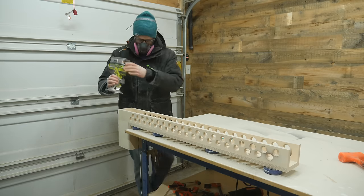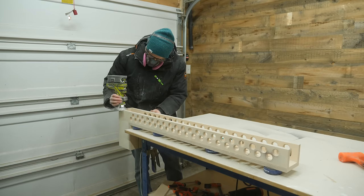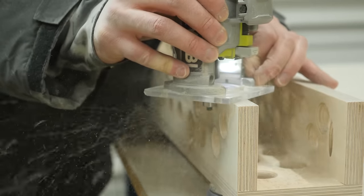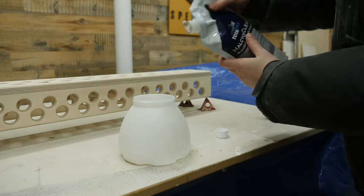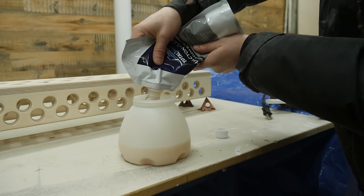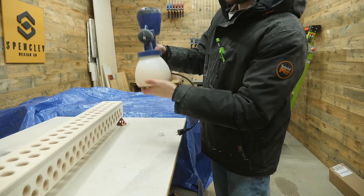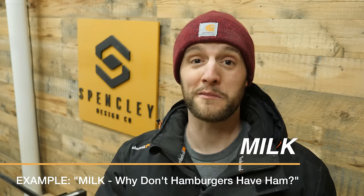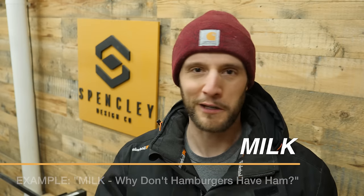To help prevent any nasty splinters when reaching overhead for the boom arm, I rounded over all the exposed edges. This is a shop project, which means finish is not required, but I'm going to use some TotalBoat Halcyon because it's really durable and dries super fast. I got a really cheap spray gun off Amazon that works fine for shop projects like this, so I sprayed on a couple coats and let the finish dry for a few hours. If you've made it this far, leave a comment down below that says 'milk' — I read every comment and it lets me know you actually watched the video.